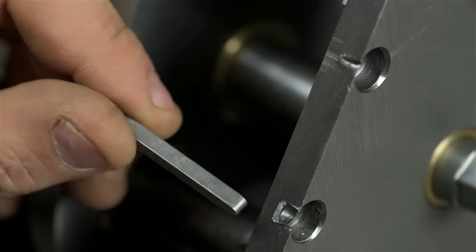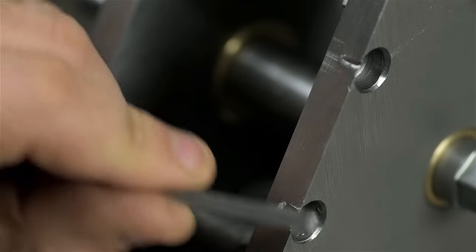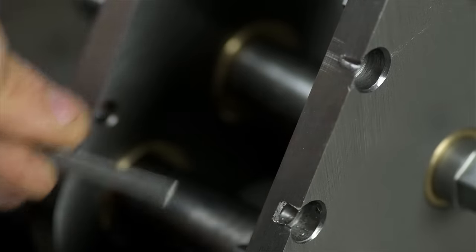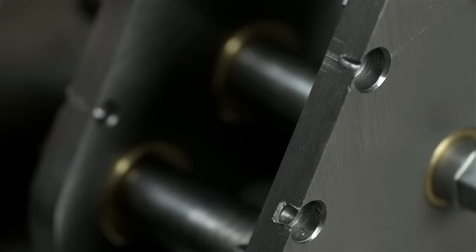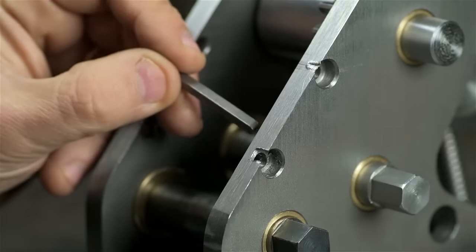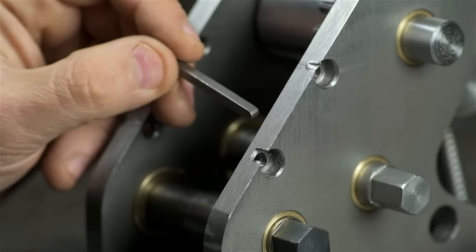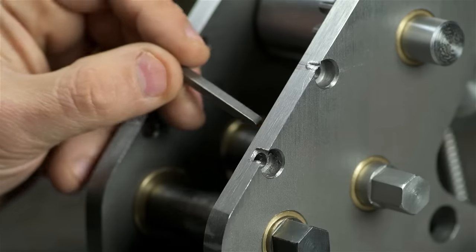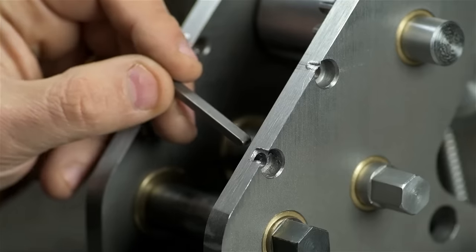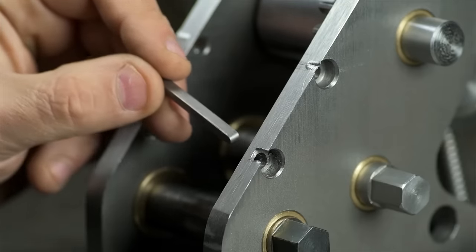Now, I'm sure everyone's noticed that my counterbores for the screws have broken out the side to one degree or another. I can feel your eyes on them. Anybody ever tell you it's not polite to stare? When these were set up and I was drilling the holes for these screws, it looked like I had a lot of material there, so I made the executive decision to move up to the next size screw. And although that's true, I did have plenty of material for the body of the screw, I didn't think ahead to the size of the counterbore needed to recess the head.